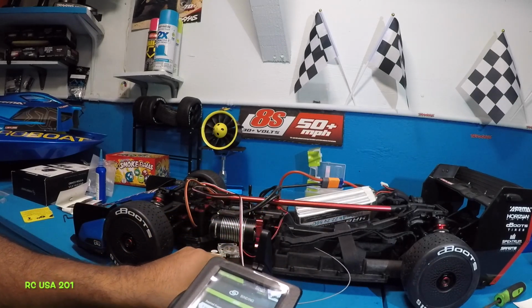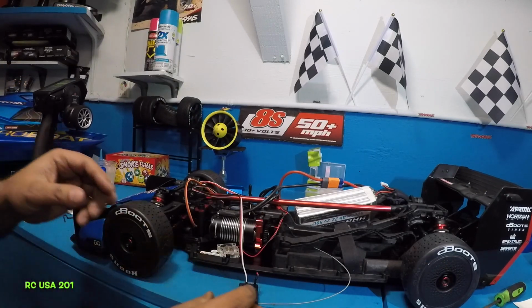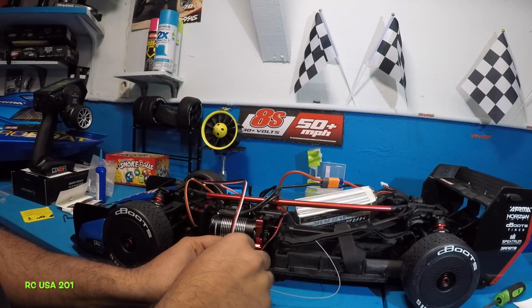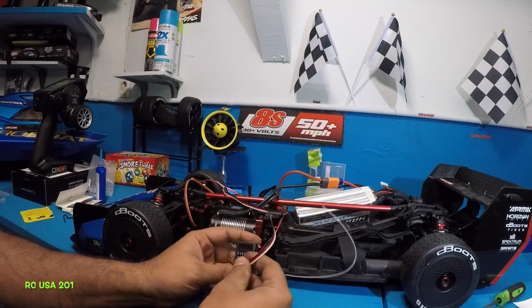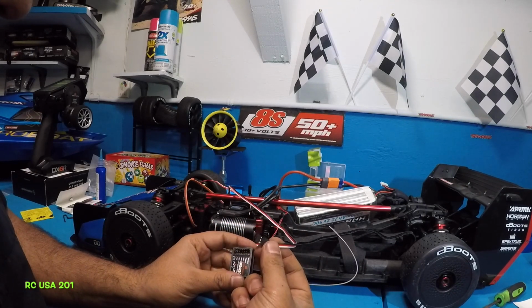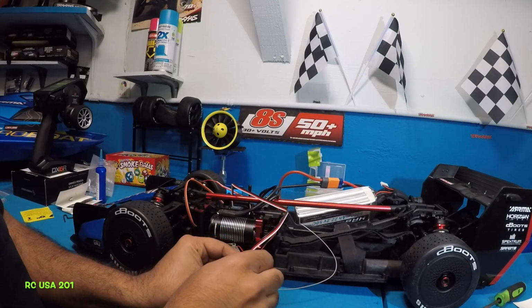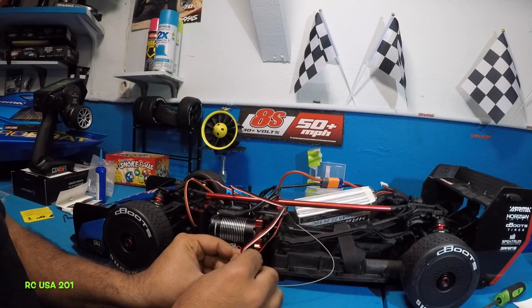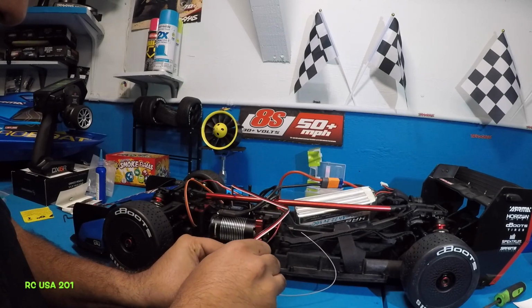All right, so that's simple, guys. It's bound. So all we need to do is turn off the power here, disconnect the bind button, and now switch the connectors here. We need to connect this to THR, thrust. That's throttle, so that's pretty much acceleration there. Should have done that in the same channel to begin with.